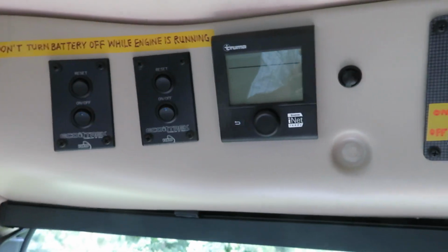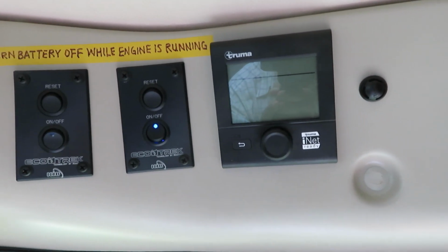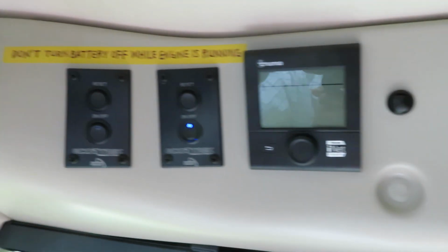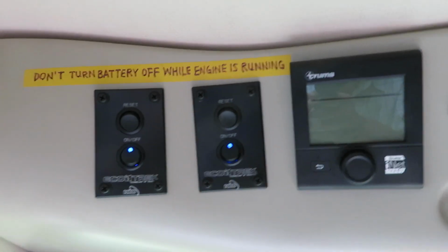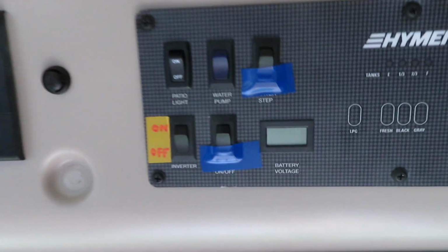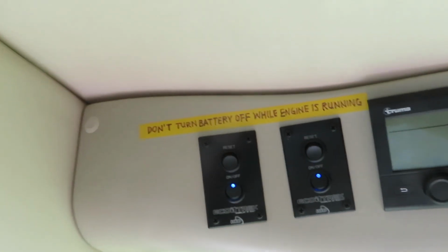So this is the procedure, very simple. You turn on one EcoTrack first. You get a blue light, you get a clunk. So you know your charge relay is closed, but this discharge relay is not, because this is off. Then turn on the other EcoTrack. Okay, we got blue light and clunk, so both charge side relays are on, but not the discharge side. Okay, so make sure that this discharge side is not on. If you see this voltmeter come on, then you are only safe to charge one battery at a time. So now both of the charge side relays are on, we can start charging.